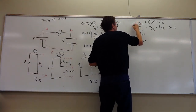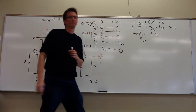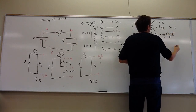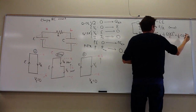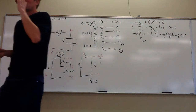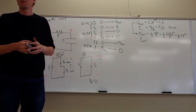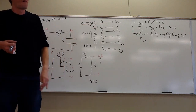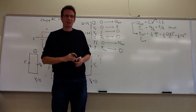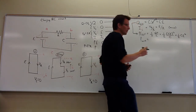For PE_full, use Q_full in the formula one-half Q²/C, or better yet use one-half CV², where V is the battery voltage. That's the maximum potential energy, stored at the end when the capacitor has everything. For P_max, use V²/R — one of the three forms of the power law — where the maximum voltage across the resistor is the battery voltage, which happens at the beginning.